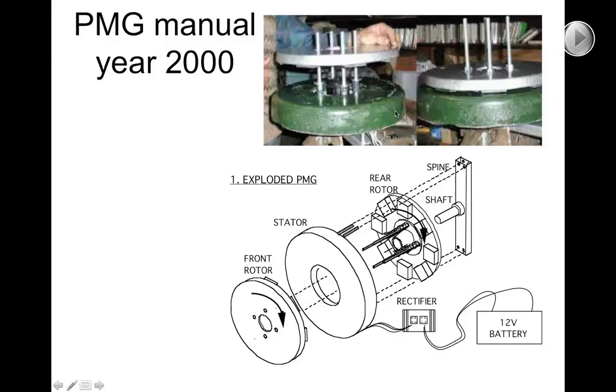In those days, my idea for the stator was to build a pudding bowl shaped thing where the back magnet rotor is concealed inside the bowl — the idea being to get a better looking and stiffer shape for mounting the stator. The downside is that you can't get at the back to check the clearance. That stator shape was one of those design dead ends that tend to occur. What seemed like a good idea was actually just a waste of time, and I wouldn't build another stator like that again except as a replacement part.